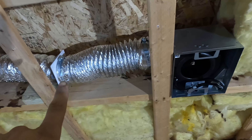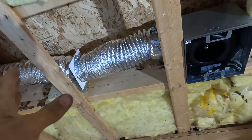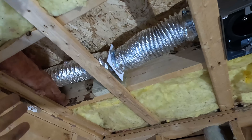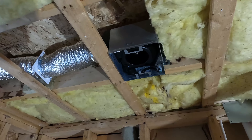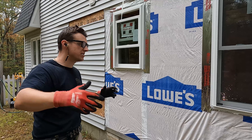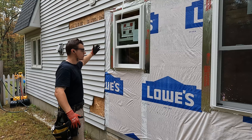What I have to do now is get the vent fan cut open out of this plate over here and then set up the vinyl siding vent. Super simple — I just put that vinyl flange right up to the siding under the vinyl, traced it on, drilled a pilot hole from the inside to know exactly where to put it, then used my multi-tool to cut that plate out and popped it in.